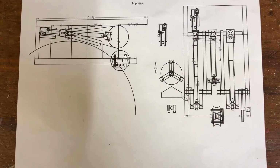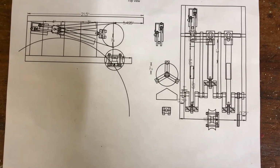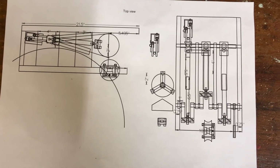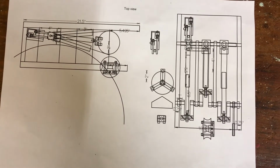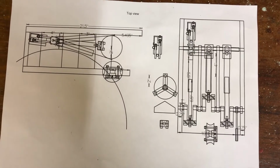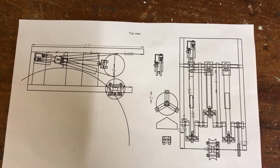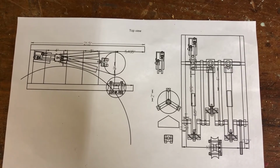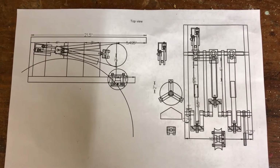Now, the main diagram is this. On the left, it shows the motion of the 3 cylinders as they rotate. In the center, it shows a round circle with 3 lobes. That will be the crankshaft. The little house-looking thing below it is supposed to be a template that I can mount these pieces on as I build that 3-cylinder crankshaft. And below is the connecting rod assembly.